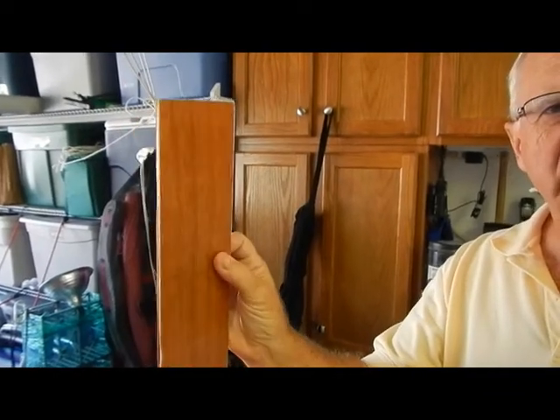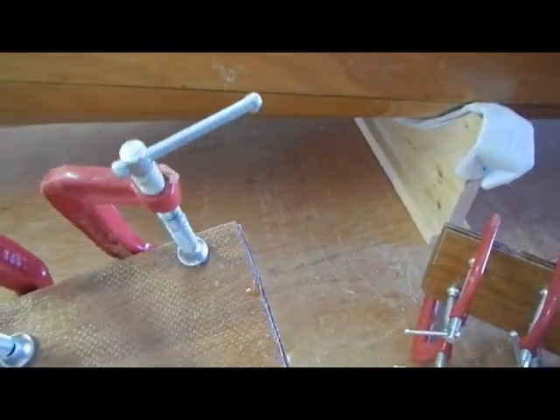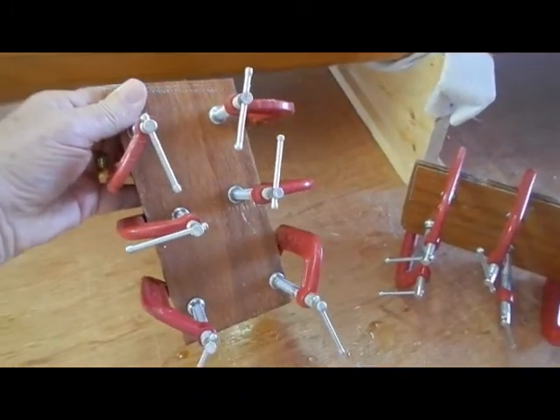The other thing I was concerned about, especially with this installation, was the mounting boards that came with the boat — they're very thin. I have glassed them on two sides, you can see it here. But I wasn't sure that once I put a bolt through there, with tugging toward the back, it would be beefy enough to really hold up. So what I did, because there was more than enough material, was to double it and laminate the two pieces together so I have a double thickness. You can see the two thicknesses of wood here. It's been measured and cut, and the top part is cut at an angle because the cockpit rim slopes down at the point where you're putting these in. I've done that with both sides.